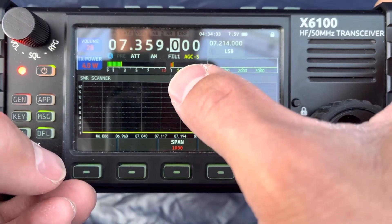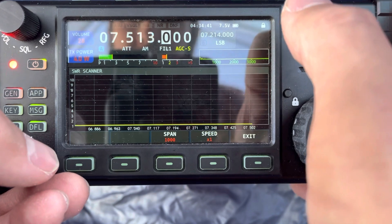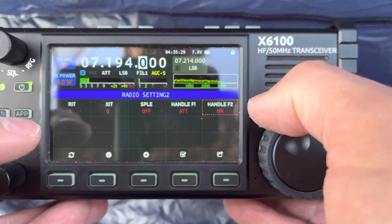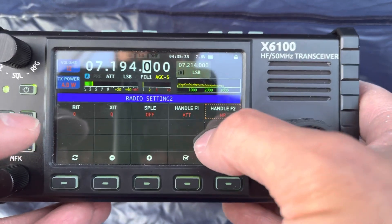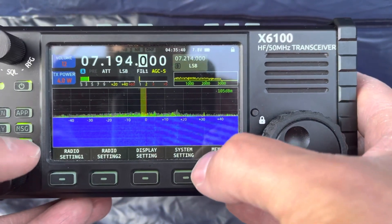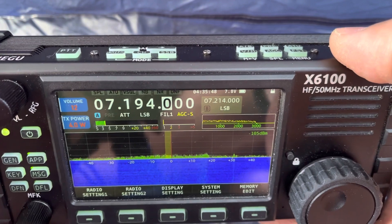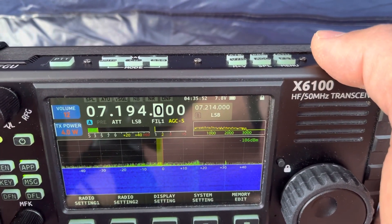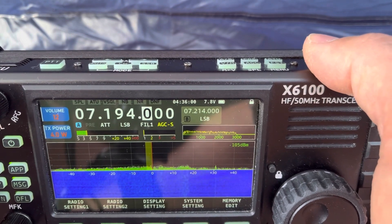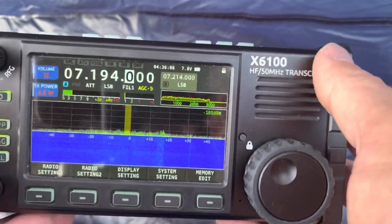You can watch the SWR meter — it shows you where it starts to climb. I'm pretty proud of this antenna. The CW trainer — I actually found it useful. On my FT-891 you just turn off the break-in and it defaults to a trainer mode. At 5 watts I was running 80 meters the other night and was able to bounce via NVIS into the Ogden area from Beaver — that SDR WebSDR antenna is about 80 miles away and I was able to hear myself. Five watts was able to do NVIS on 80 meters at night, and this radio was plenty adequate for that.